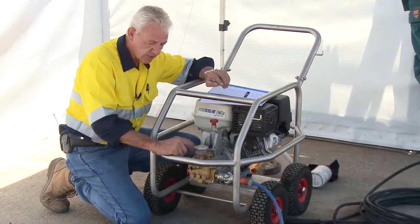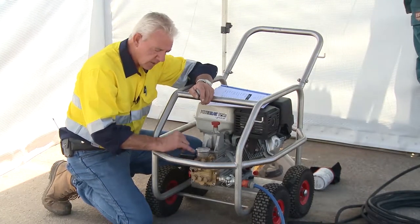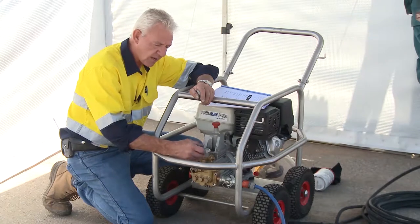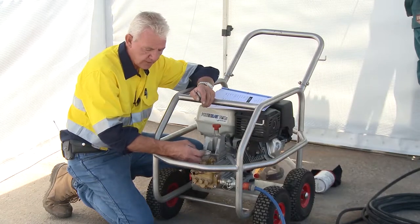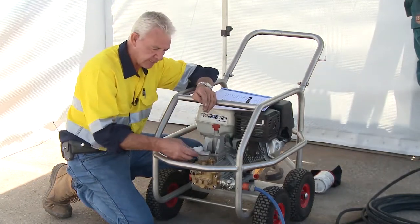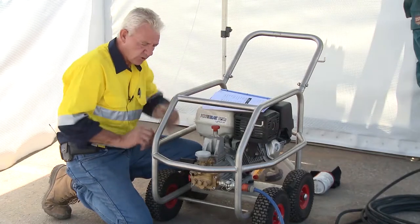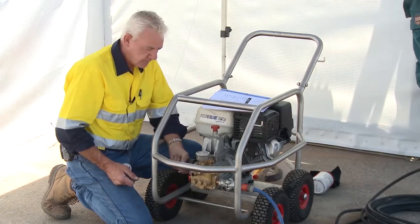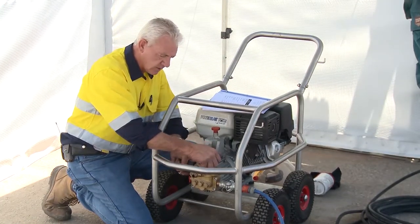If the glycol runs out or the glass is damaged, you need to replace it immediately. The gauge has a venturi entry where water pressure builds up into the chamber — if you lose the glycol or damage the gauge, the water has somewhere to escape and you can't read what the pressure is doing. The cover is on there for a reason; remove it when establishing the pressure for your job.